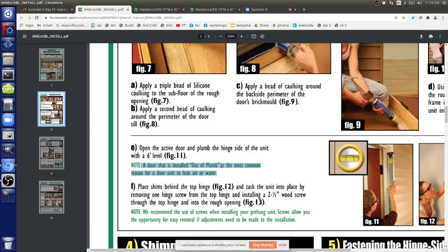So I guess we do it in both directions. Maybe that would have solved everything. Because what we did was we put the six shims around the six hinges, thinking that if we put in a closed door, well, you have those little shims behind the hinges. We took out one screw at each hinge and put in a long screw to attach it. We thought, okay, that might be good, but we found out that it actually shifted a little bit.